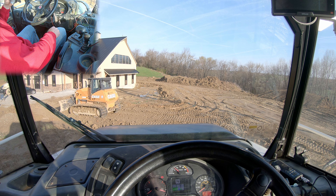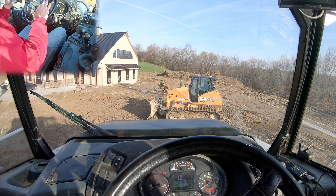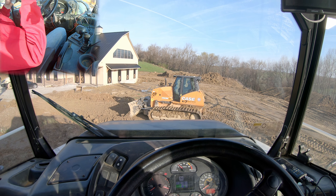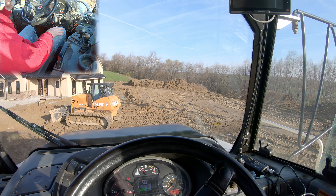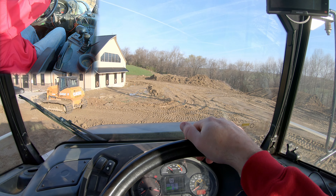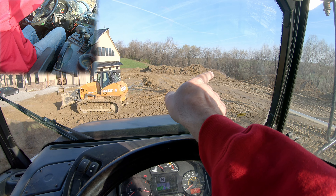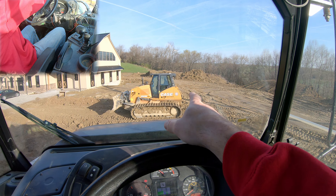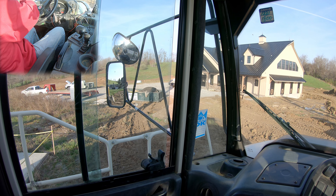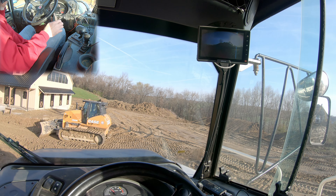Because these trucks articulate in the middle it takes some time to get a feel for how they move. Especially if you've got a really crappy backup camera like we do here, make sure you pick out a visual reference for where your tire needs to go. We had that little rebar with the cap — I knew my tires needed to be on the right side of it. I looked in my mirror until I could see that piece of rebar and my tires, then cut the wheel knowing we'd go around it. Then we could focus on the crappy backup camera picture to make sure we were centered on our dozer.